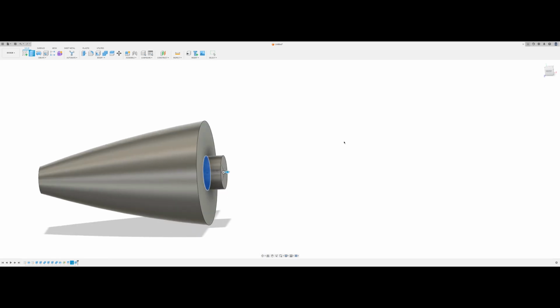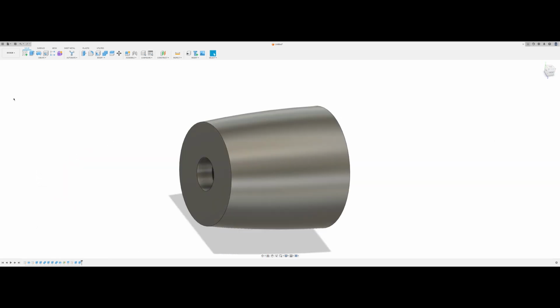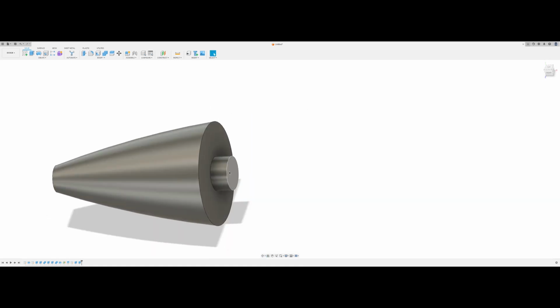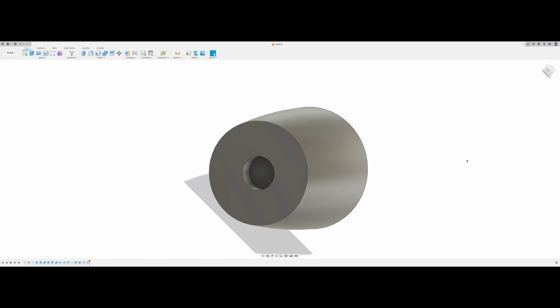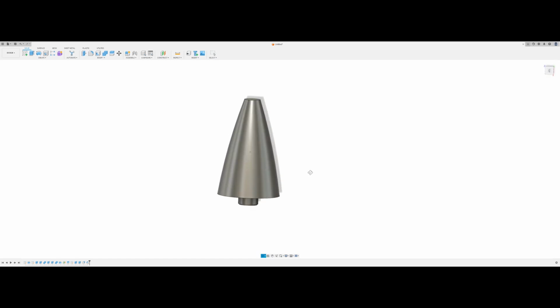Here I'm using a simple dowel pin style keying feature, but in the past I have also used threaded extensions and holes to attach parts together. One thing I'm doing wrong here is putting the male end of the dowel on the top section of the mandrel. If I put it on the bottom section, it would be much easier to print, only needing some bridging over the top of the hole on the upper section.